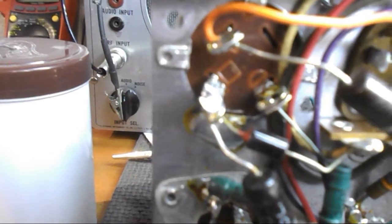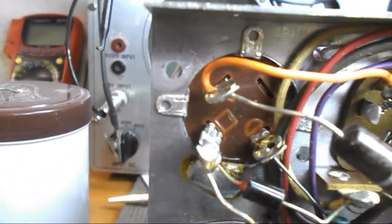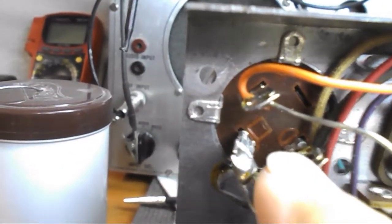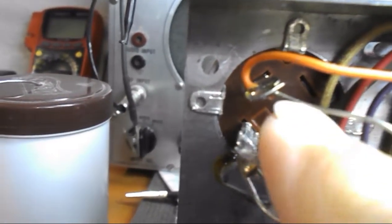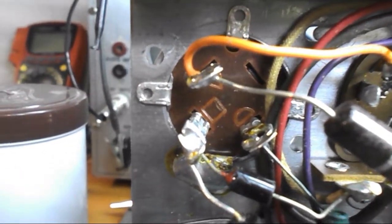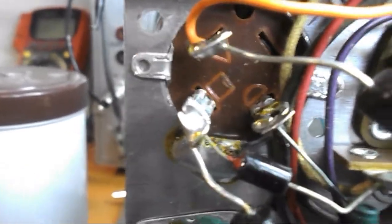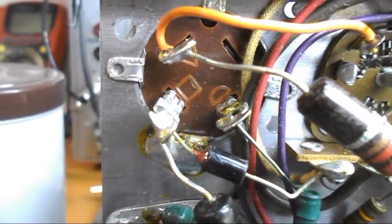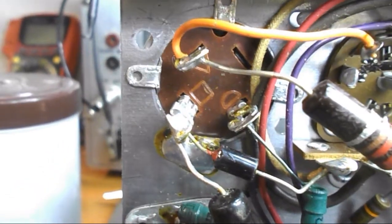There's a diamond, a square, whatever, at the very bottom. And then it also shows on the can itself what those mean on the side. Like in this case, it's 50, 50, and 40 microfarads. So if you take a look at the bottom, it'll say down here what each one is. You'll see a square and a triangle right there. You can make them out. And it does the same thing with the other one. They have those so that you can tell what the capacity or the rating is for each capacitor, so you won't get messed up that way.